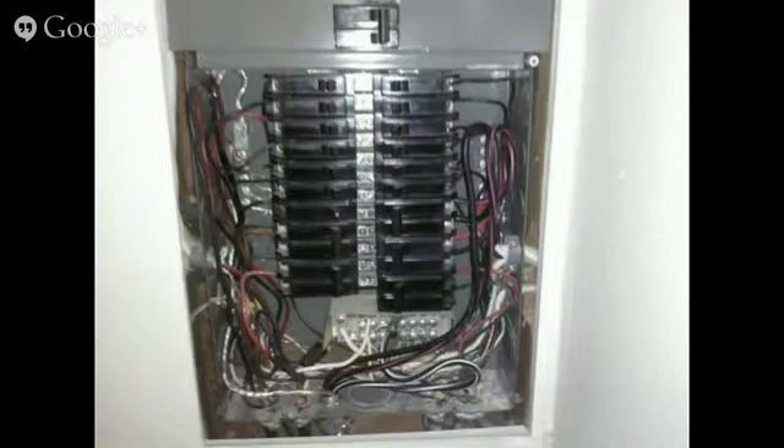So we opened this up — it has aluminum in it. Here's the same house with a receptacle that has overheated. If you zoom in, there are scorch marks actually on the wires. This was a serious fire risk; the aluminum was too far gone and they had to rewire the house. That cost around $10,000 to $12,000 to rewire the whole house, including all the drywall work. This was a big find.